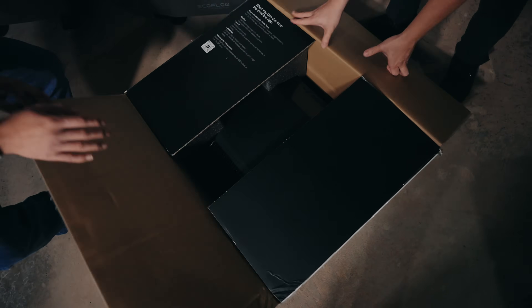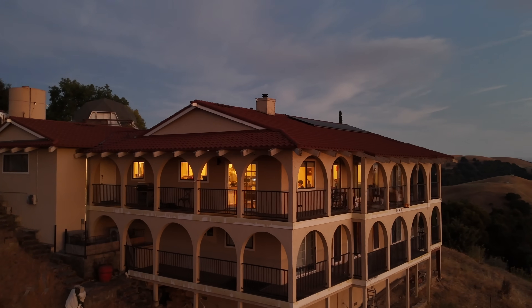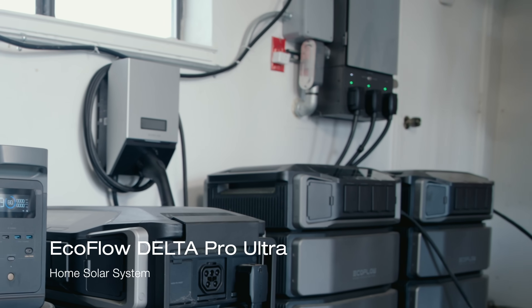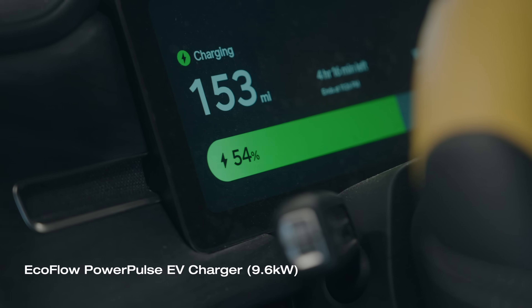You just got your second Delta Pro Ultra X inverter delivered. What's your system's capability now? The capability is now doubled — the output is now 24 kilowatts and the solar input has also doubled to 20 kilowatts. This is super important knowledge for folks who already have Delta Pro Ultra. Those systems are great for different size homes. In California with a warm climate, two Delta Pro Ultra units are fine for me. But if you live somewhere that requires geothermal or heavy electric heating, you'd really need something larger. One of the nice things about Delta Pro Ultra is you can buy another inverter, but with three inverters you lose the ability to get EV charging. Some of us really do have to upgrade to Delta Pro Ultra X for that kind of capability.